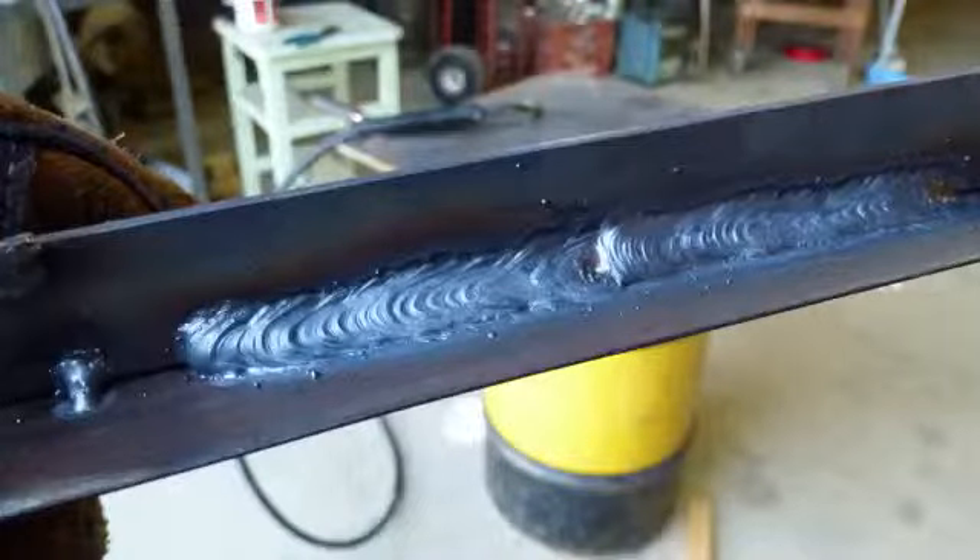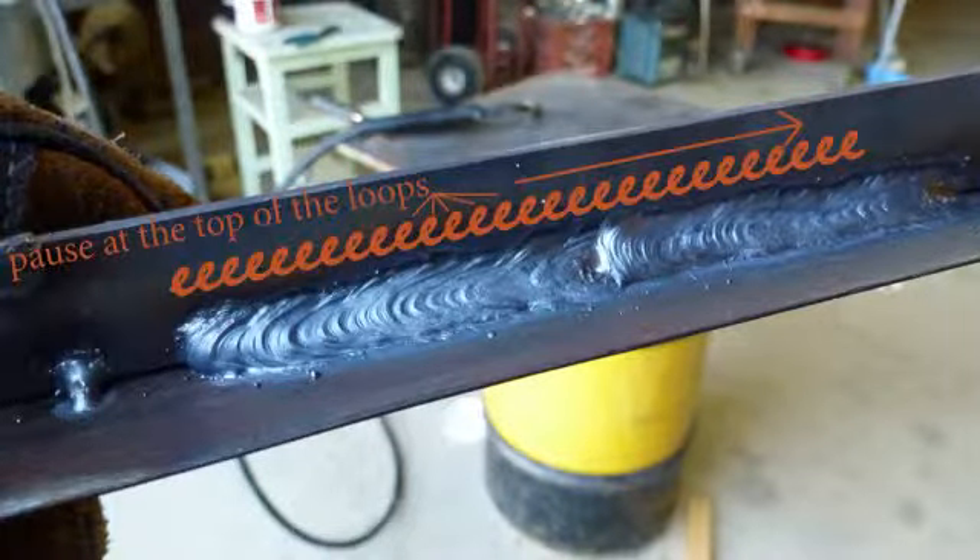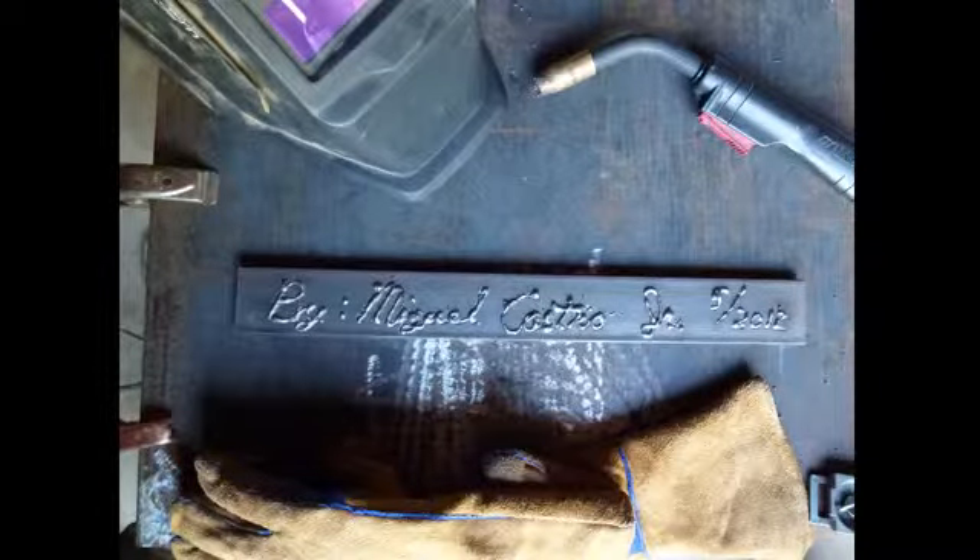The best way to become a better welder is to always have a good ground, a short stick-out, the right MIG welder settings, and a good technique while working smart and safe. More importantly, the only way to improve is by practicing. This concludes MIG Welding for Beginners.